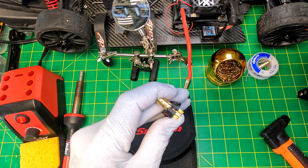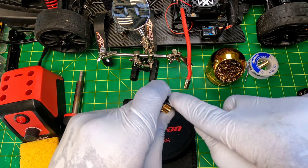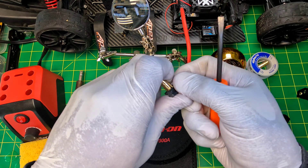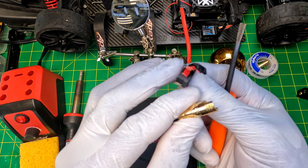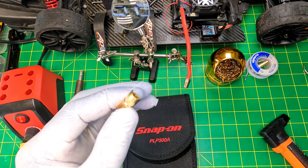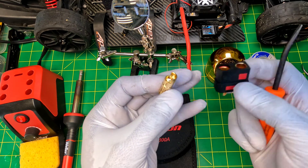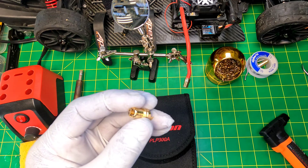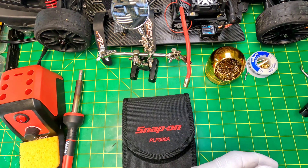This QS8 connector is just a pin, or like a slot with this red that's filled — that's keeping this connector to the bullet. So as you can see, that's all that's locking that in on the male side. It does have a 5.0 or 5.1 ohm resistor, so when you plug this in it doesn't spark — that's why they're called anti-spark connectors. I'll go over that in another video. This video I'm going to show you just how to disconnect, take off a bad connector, and put a new connector on.